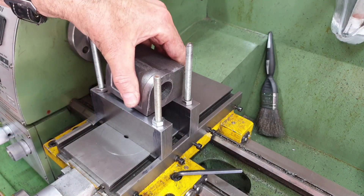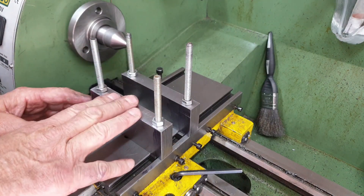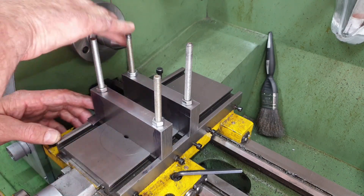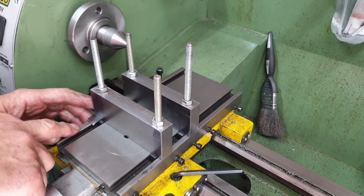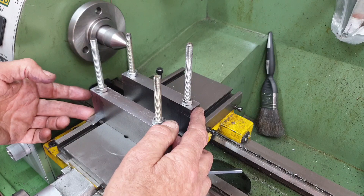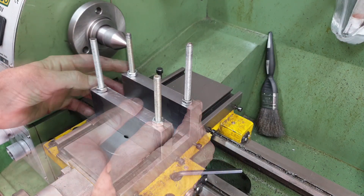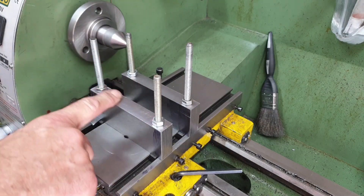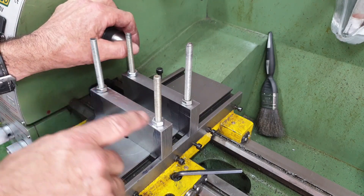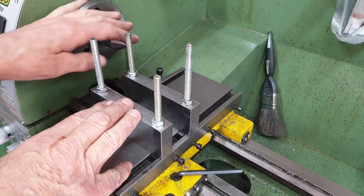I'll be positioning the cylinder block somewhere round about here. Unfortunately what I discovered after machining these blocks is that the surface of the saddle is not parallel with the spindle bore — it slopes from front to back. To deal with that I've got some shim stock underneath the two lumps of mild steel I'm using to support the cylinder. The surface of both of these blocks is now pretty damn parallel with the spindle bore — I think I've got 0.01mm variation across around about 75mm. Plenty good enough.